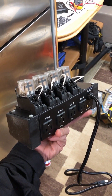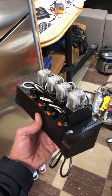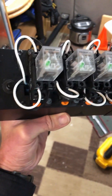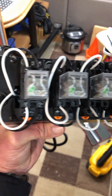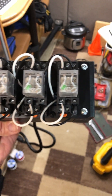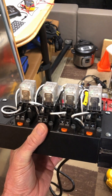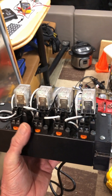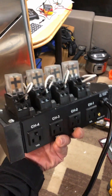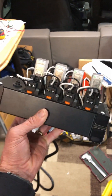I've removed all of the old manual switches and replaced them with these 12-volt relays, mounted them on top, and brought the wiring through the gaps in between each one, which worked out pretty well. And right here are the 12-volt contacts. So we'll bring 12 volts into each of these, and then we can switch AC on for any of these outlets. I kind of hacked this box up, but it worked out pretty well.